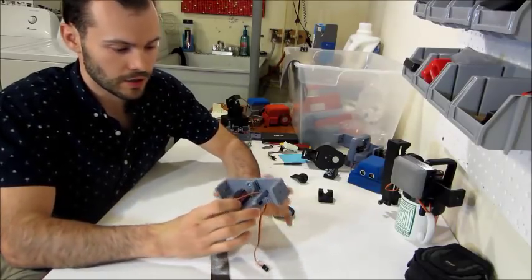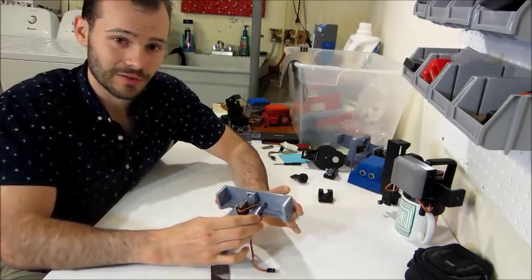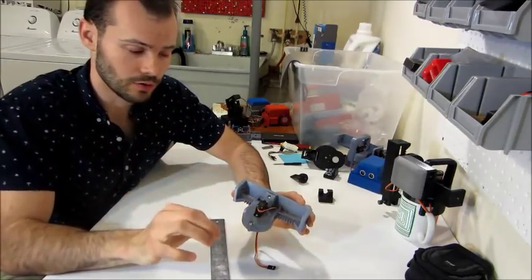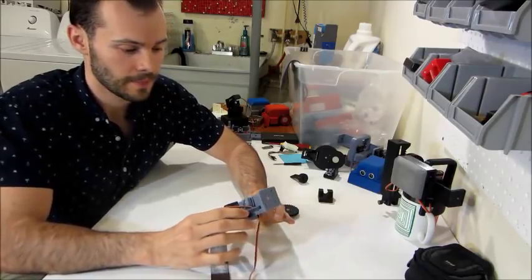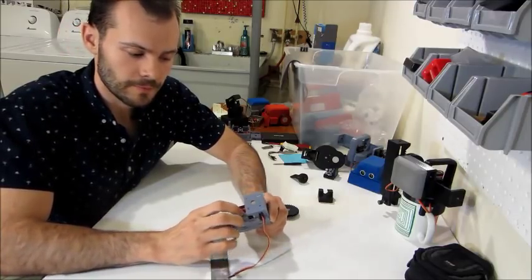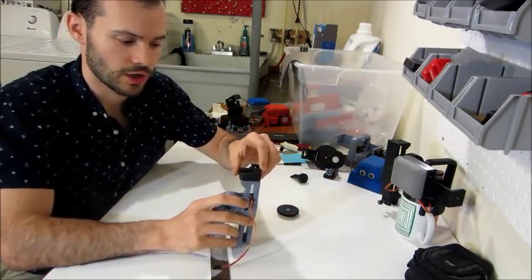What else is cool about it is it uses the same type of screw everywhere — a plastite screw. You just have a regular plastic hole and it digs in, creating a nice reusable threaded hole without needing a nut, glue, or an insert. I'm also sticking with a standard four-hole pattern on a 20 millimeter spacing with this module and some accessories I'll share and work on in the future.